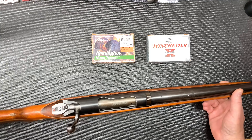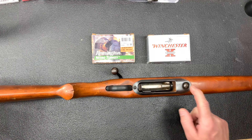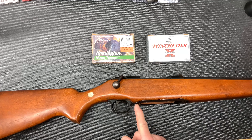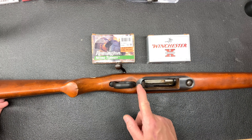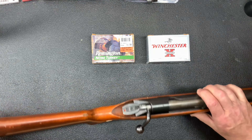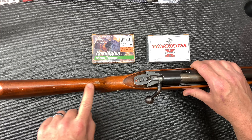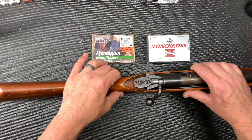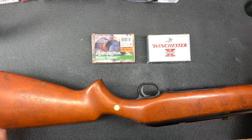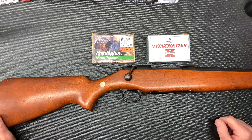I used a little steel wool and oil on the barrel and got the majority of the rust off. There were many splits in the stock — several in the front, some on the bottom, some across the back, and some in the middle of the magazine well. I fixed those with Gorilla Glue and wood glue, as well as putting a bolt and nut with a washer here to draw the cracked stock in on itself. That's why you see the wood putty here — otherwise you'd just see a bolt head and washer. We haven't sanded and stained it yet.